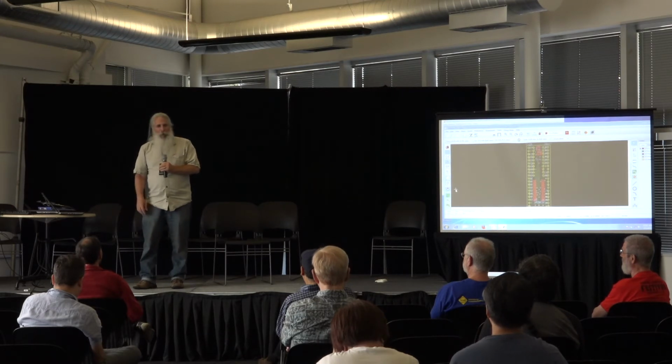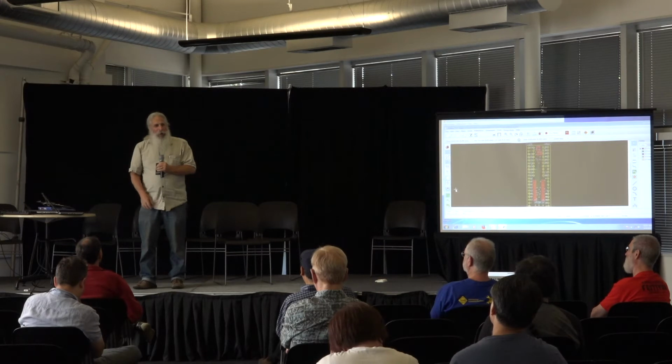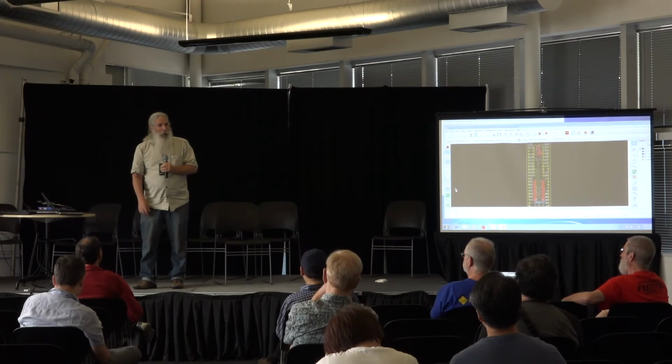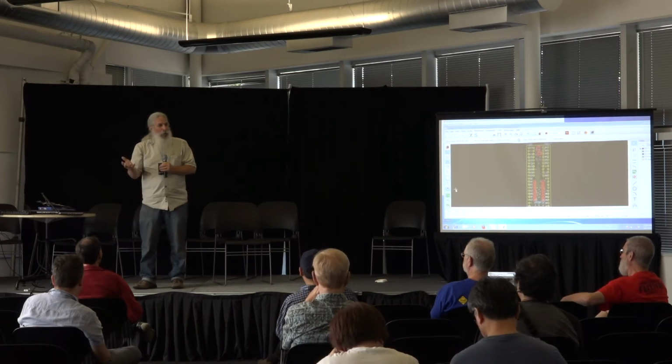The ones I use for this were all pretty trivial. If you stop by and look at the code that I have in the book, you'll see that I don't have any useless labels in there. There's no L1, L2, L3 kind of labels, because I do all the code with structures. I have begin-until structures, if-then-else structures, do-while, repeats, whatever. So the code is all built that way. I very rarely put a branch instruction as a branch instruction in my code. There are purposes for it, but in most cases I use one of these structures to create the branches for me.